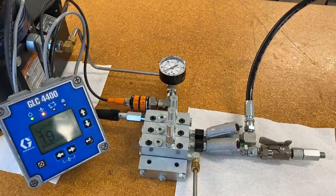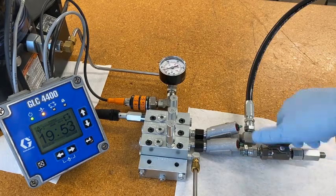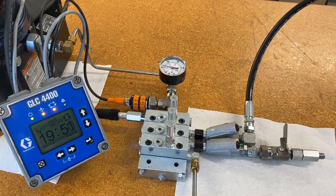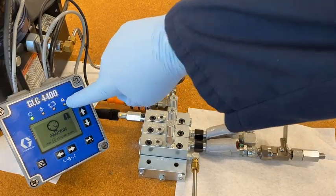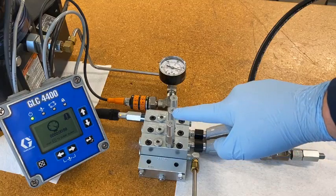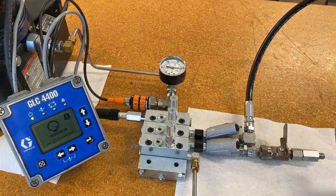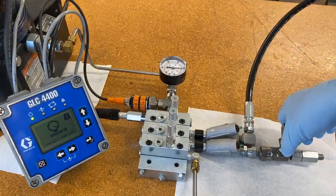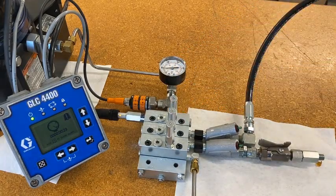We're going to hit manual run on the controller, and first I want to demonstrate what happens when you have high pressure from a blockage. I'm going to close that ball valve. We've got the pressure fault on the controller display, the alarm light is flashing, and we see a pin popped up here on the reset indicator. It won't let us press it in because there's still pressure. I'm going to open my ball valve — that's going to relieve most of the pressure. I can press my pin down. That all makes sense because that was a high pressure situation from a blockage.